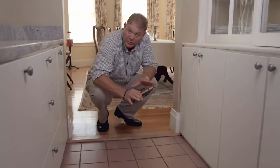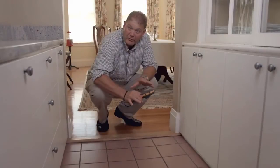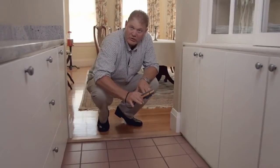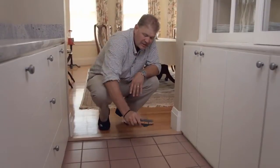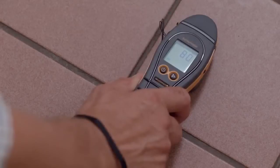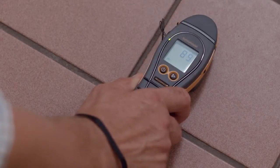The deep wall probes are particularly useful if you want to look for moisture deep within a wall surface like a brick wall. Simply drill two holes, plug them into the meter, and take a reading. You can use the Survey Master's search or non-invasive function to look for moisture over large areas. In this case, we're going to look for moisture behind this tile. It's important to place the meter on top of the surface rather than slide it. This meter is reading about 90 with a green indicator, meaning that the floor is dry.